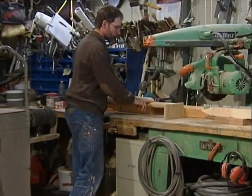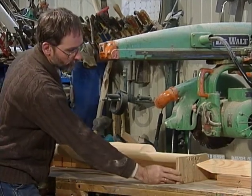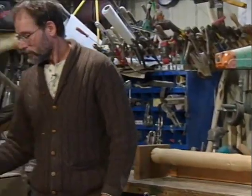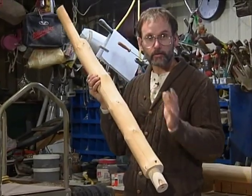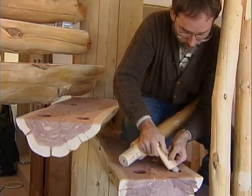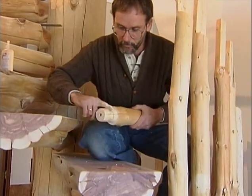To make our cut on the top of our spindles to receive the laminated handrail, we went to the radial arm saw, set our part up using centerline design, made all the notching with the radial arm saw to bring the last cut to 27 degrees, and set a stop at the end so each cut is the same length. Then we sanded knots on the air drum and took the whole part across the bristle sander to get it perfectly smooth. We're counting on the glue and precise fit to make our structural joint — this is going to carry weight, tying all our stair treads together, so we want a good, precise, solid, immovable glue joint.